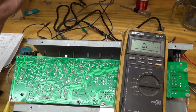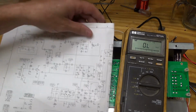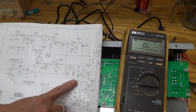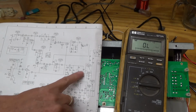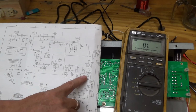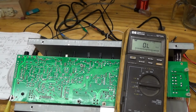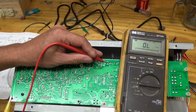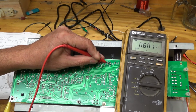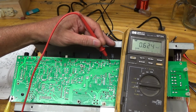Okay, so this is my bass. The reason I'm looking at the bass is because the bass is actually grounded right here, and if we're not grounded properly, that might affect how this is working in here, and it might up the gain here. And so I'm looking at this pin right here, which should be to ground, it's half a meg to ground.